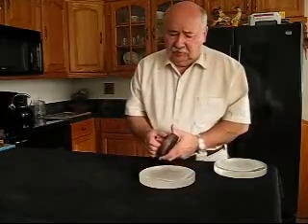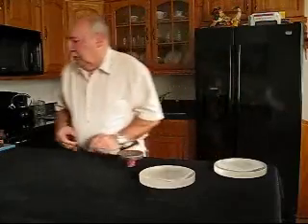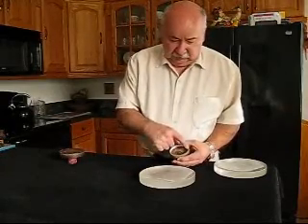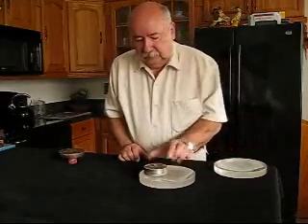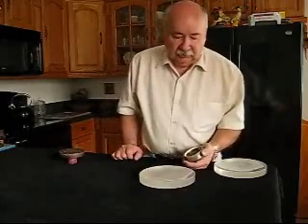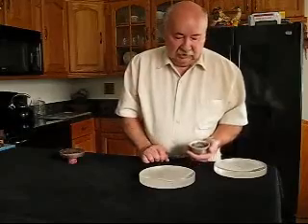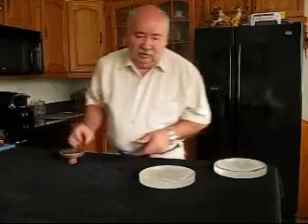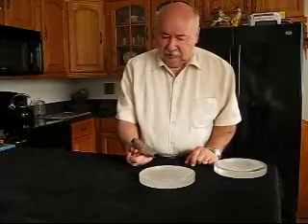So I would recommend a piece of steel or cast iron to grind it, although an even better way is to take a diamond tool. This is a diamond tool that I use on a machine, but you can take this — it's got diamond embedded into a matrix around the rim — and you can use that to grind your curve. With a diamond, practically everything that comes off is glass. A diamond matrix wears away very, very slowly. You can make thousands of parts with a piece of tooling like this. But you probably won't have this. What you could do is go down to Harbor Freight — I think you can get a four-inch diamond wheel for like $6 — put that on a piece of steel and use that. It'll just never wear away. That's a pretty efficient way of doing it.